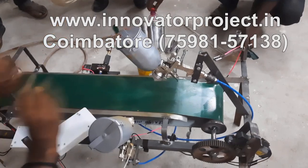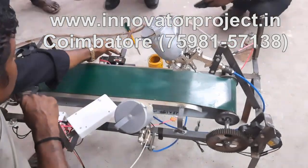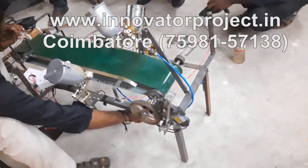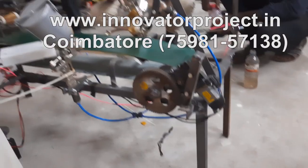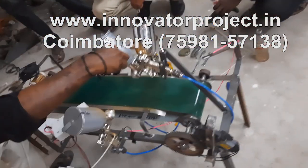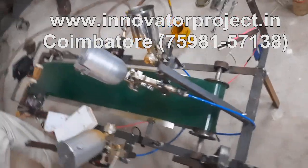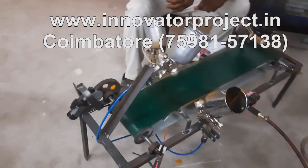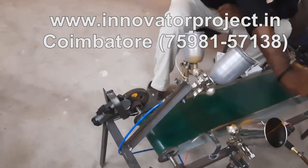At that time the spraying density is varied with the flow control valve. The air will be coming in and divided into 3 spray portions: 3 side rails and on top 2 side rails, spraying for 1 second. After 2 seconds the timer will automatically finish. This is a continuous working operation — whenever a workpiece comes, it will automatically spray.